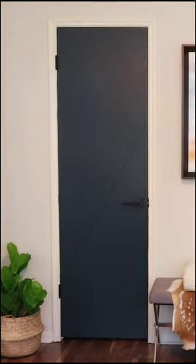PSA: for the love of God, don't forget to sand your original paint job like we did. Because if the door was originally painted in oil-based paint and you go over it with latex, it is all going to peel off — insert all the tears we cried here. But we fixed it and now we have awesome looking doors.